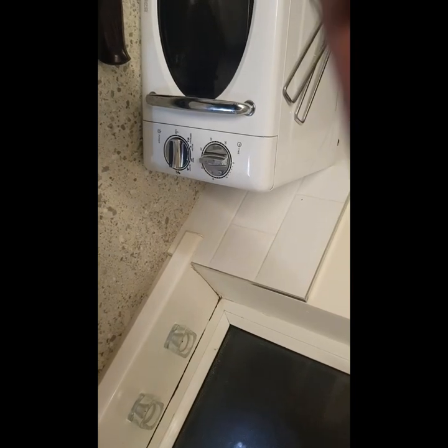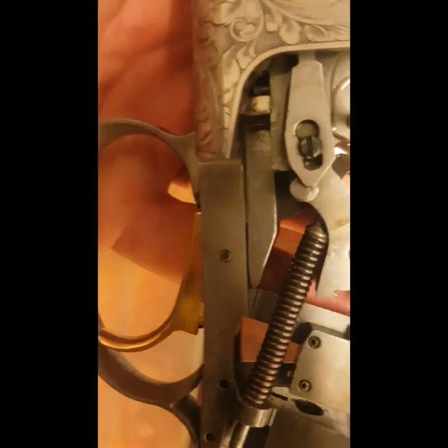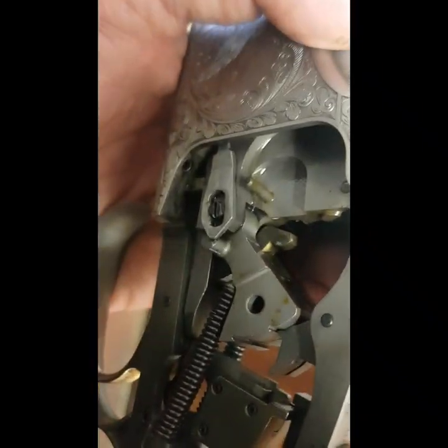What I got next was this — just a little sort of punch. I was able to get it down so far, and once I got it down to a certain point, I then resorted to my smallest Allen key — a 2mm Allen key. It was a bit rough on it but I hammered it and eventually it came out. The pin is actually still there on the other side — you can see it just sticking out where my thumb is — so I've left it in.